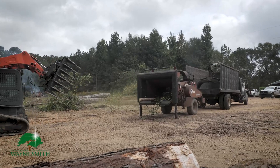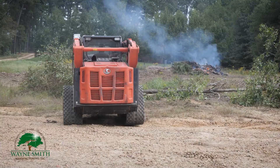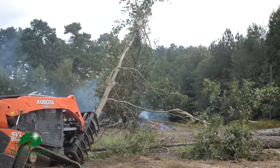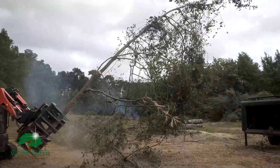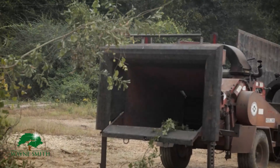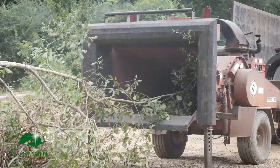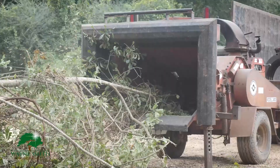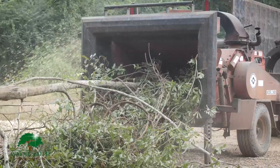Here's an oak tree full of vines that would be very difficult for anybody to hand feed. We'll go vertical with it, turn, and all you do is line up with the chipper, ease the top down, ease forward, and just keep it in the middle. The chipper feed adapter will fold all the limbs back. As you can see, it starts feeding — all these vines represent no problem because you can push right in there with the adapter grapple and just feed it right on in.